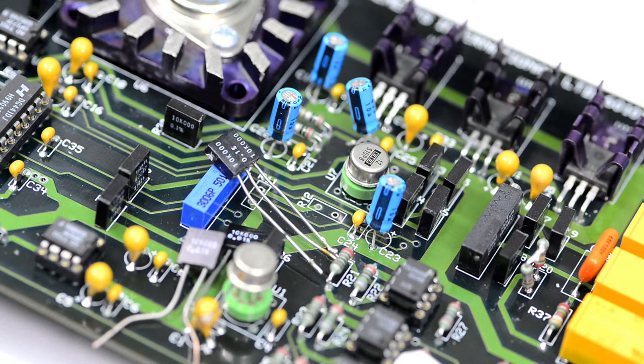What do you guys think? Two discrete resistors. Well, anybody else? Third option. There is no third option. We need two 10 kilo ohm elements over there. Original. Since we are at it, I like to replace things. And we can test the original resistors in future experiments.